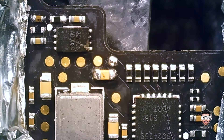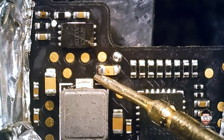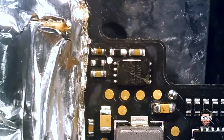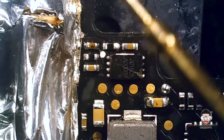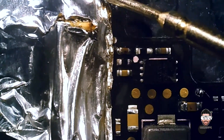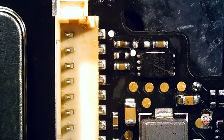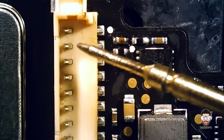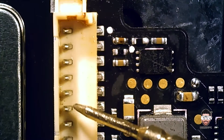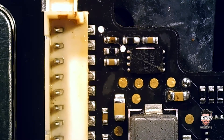Okay, let's do a component check again. My multimeter is in continuity mode. We don't have a short anymore, and we don't have a short here either. Let's check the battery management main lead input as well — look at that, we don't have any short anymore. It's gone. Okay, we are good to go.